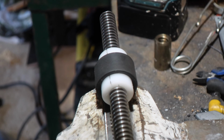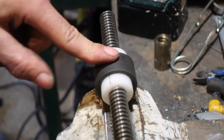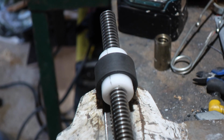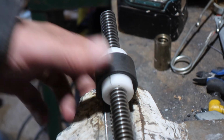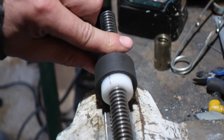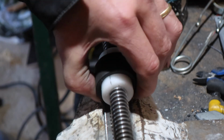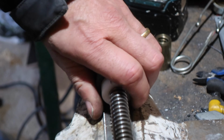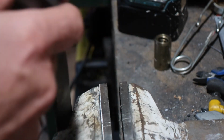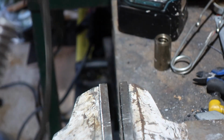There you go. Handy tip, these serpentine belts. I went down to the garage and borrowed one. I actually wanted to use it for the lathe, but it's too long. They make great strap wrenches, and you can hold slippery stuff really well. You just clamp it in the vise just slightly underneath and keep pulling until it goes tight. They're pretty much indestructible and fantastic, dead handy to have around.